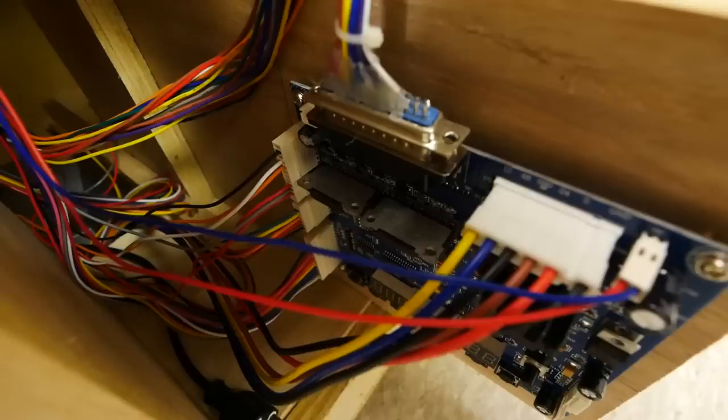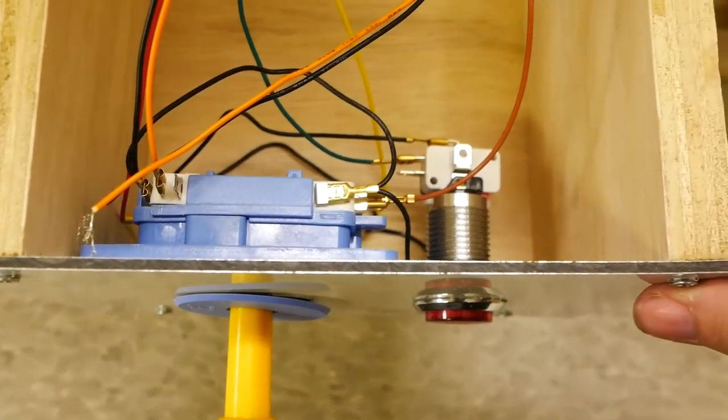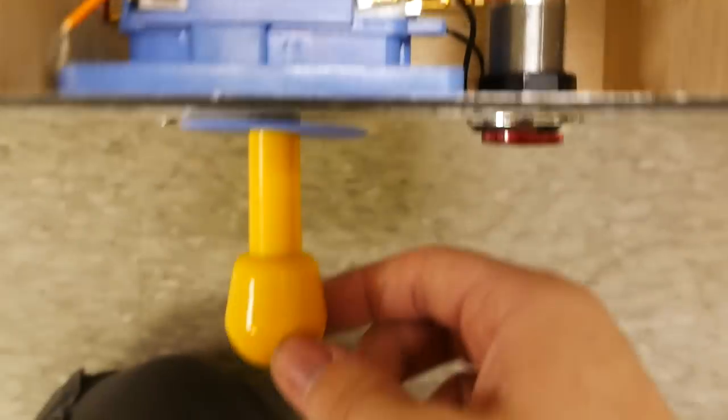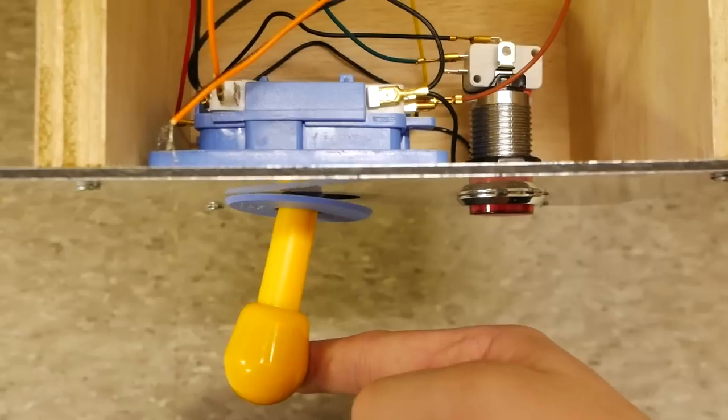The joystick plugs in here, then each colored wire at the end of the joystick connection means a different movement. For example, red means backwards, yellow means forward, and then the green one means drop the claw, etc. You attach each wire to the opposite direction underneath the joystick. Then the ground wire connects with those. So for example, if you want to move the claw left, you attach the left wire to the right switch.